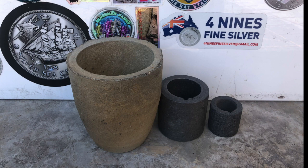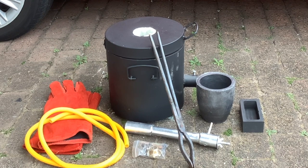Next up we have the graphite crucibles, which are made up of graphite and fire resistant clay. They are an excellent product - these crucibles can stand up to extremely high temperatures and they won't expand or contract. These crucibles are excellent for melting gold, silver, and copper with induction heating, which simply means the crucible heats up to melt the metal with no direct fire onto the metal, so it burns and melts extremely clean. The only drawback is they do not work with my torch at all. With induction heating you need to heat the entire crucible before the metal will melt, but they work extremely well with a furnace, which heats the crucible with an even heat caused by a vortex that spins around the furnace.